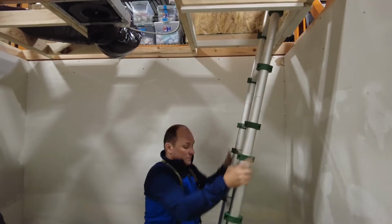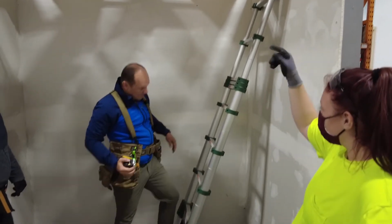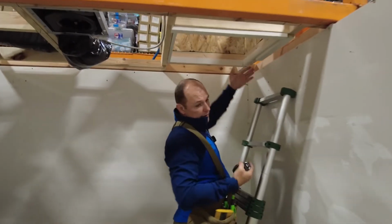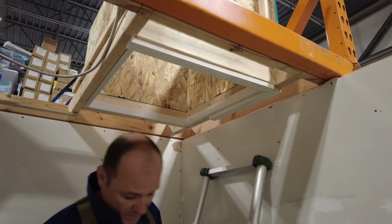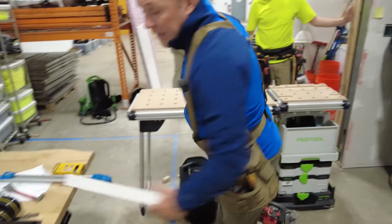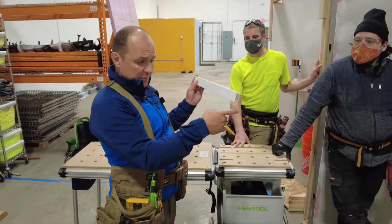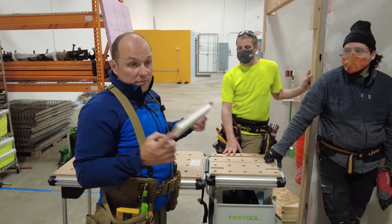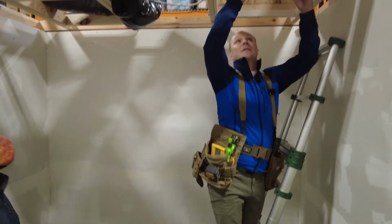When you said you put it above, did you say the cut again, like put it up there and then? So what I've done lots of times, I have trim here, right? I can't always measure from the bottom. So what I would do is say, okay, my piece is going to be 21 inches, rough, right? So I can grab another piece of white 1x2, so I know that when I finish cut this, it's 21 inches. But I really have 1.5 inches because it's going to be inside of another piece of 3/4, 3/4. So I'll make it 1 inch longer. That'll give me some wiggle room. So then what I can do is put this up in here and it'll slide.